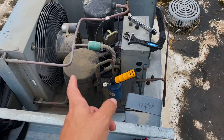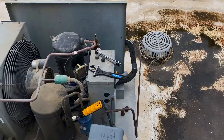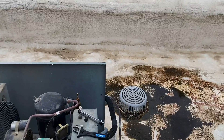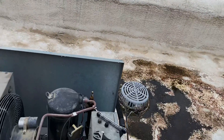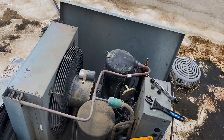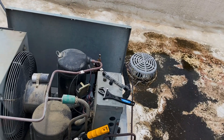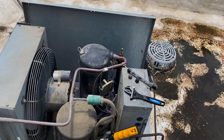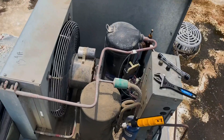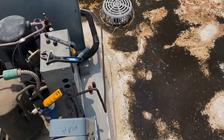It's 35 inside right now, so I'm assuming somebody put R-404A in it and it's still running. I was down there and it was already 35 — it's a cooler. I think they have the thermostat set too low. I'm gonna go back down and see what temp we have — maybe that's causing the icing, because their complaint was that it had iced up. I'll raise the thermostat for now and do a follow-up. I need to check notes or talk to a co-worker since this is my first time on this unit.